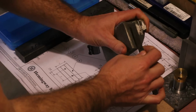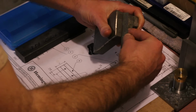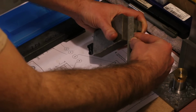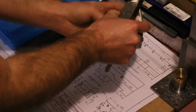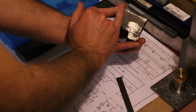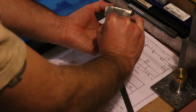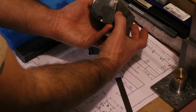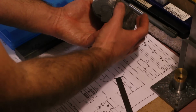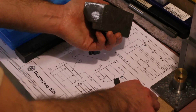So if I measure from the other end here, from the lowest part of that low spot, we've got about 2 1/16 inches. So our critical section through this part this way is from the front surface here to this lowest part in the casting here. These are the sections of this casting in the rear that will remain. These will be the sections outside of the female dovetails.